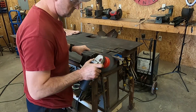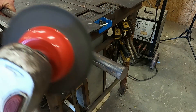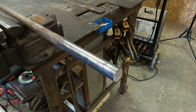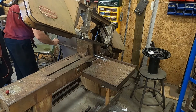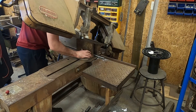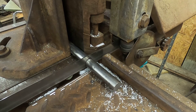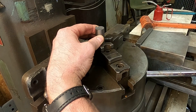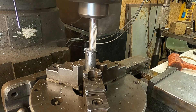It'll also provide a more consistent surface than the machine table itself, which has accumulated numerous small nicks, dings, and scratches over the years. I start out by cleaning a piece of three-quarter-inch diameter bar stock before cutting off a piece approximately three inches in length, and then I machine both ends of the part smooth and square.